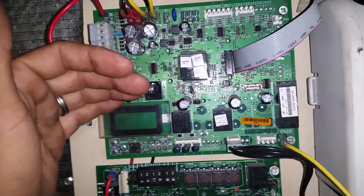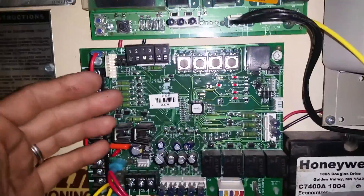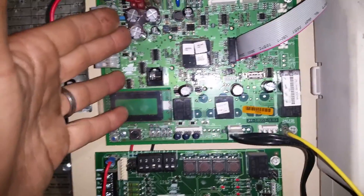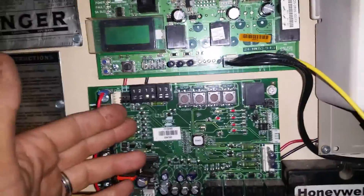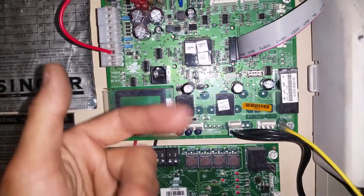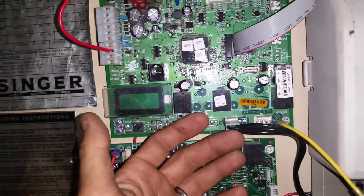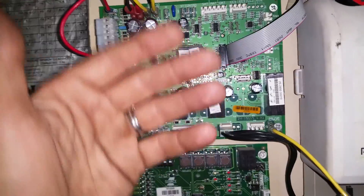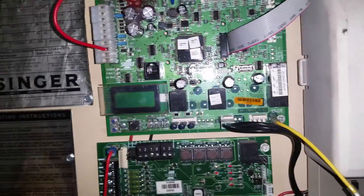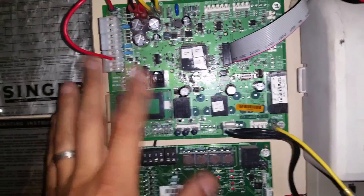You're going to find that in about a year or two, if this board goes bad, you're going to get a retrofit kit — take an SSE board and replace the 1A board or the Light board with it. Get ready for that. It's already happening. At the same time, it's going to happen with the Millennium board, that large board we talked about. You're going to start seeing the SSE board in a Millennium fashion, replacing those old boards.